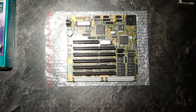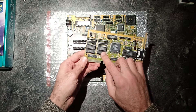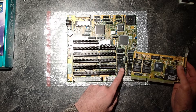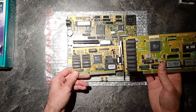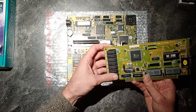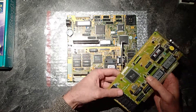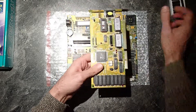The interesting thing about DIP memory is that it was also used on graphic cards. Take a look at this Western Digital graphic card — it has eight DIP sockets and you can put up to one megabyte of memory into it, but it currently has only 512 kilobyte of RAM. These are the same chips which you could put on this mainboard. Another famous example is this Tseng ET4000 graphic card, which has eight chips and all in all one megabyte on top.